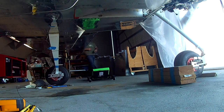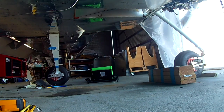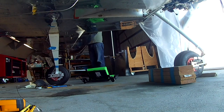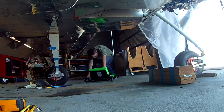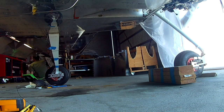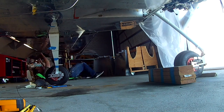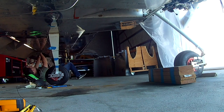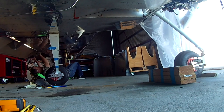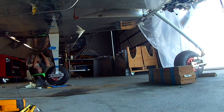Now here's the nice thing about re-rigging the ailerons as I described before: as long as you've got the two jigs that Vans uses, the last push rod that actually actuates the ailerons should not change at all. The only thing I really have to do is go and shorten up the big push rods and the hex stock piece that goes from the control arm to the control stick. But even that — just getting it to be square — still takes a couple of hours to get right.